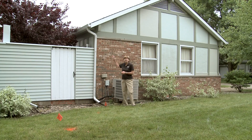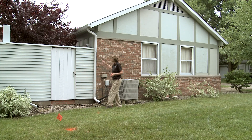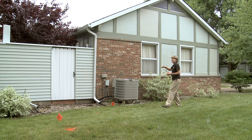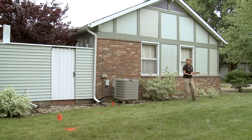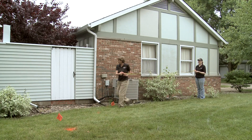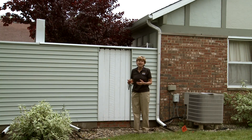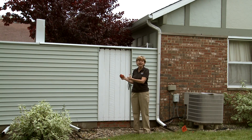This rain garden is going to capture the flow from this downspout here and this downspout over here, so we'll be measuring each of those. Starting with the first downspout — it's capturing this side of the roof from the gutter over to the centerline of the roof. We don't want to measure the rest of the roof that's flowing the other direction. This roofline is complex — it's a rectangle with a rectangle cutout for the patio, which is pervious and won't count toward the rain garden. So we'll measure the entire rectangle and then subtract the patio rectangle.